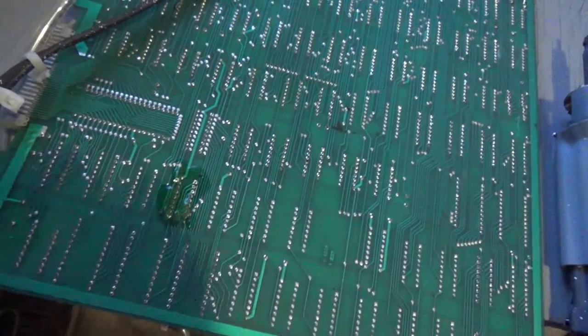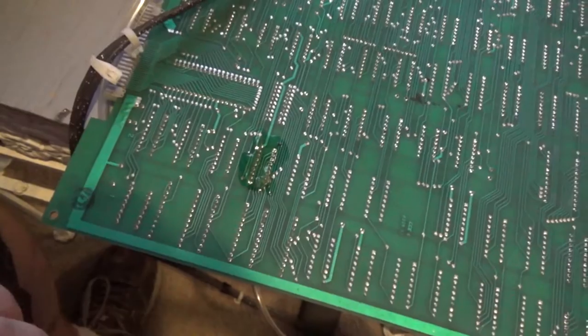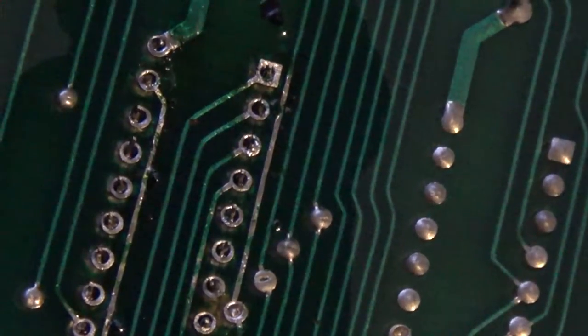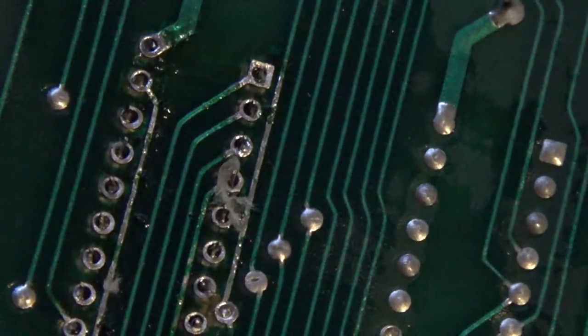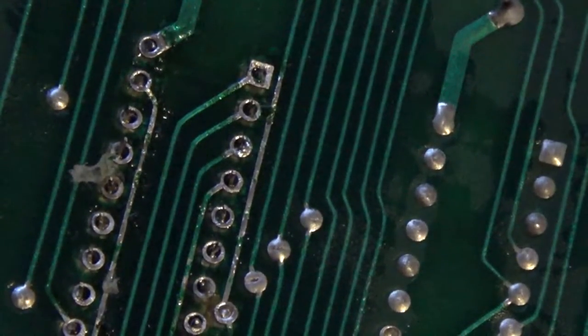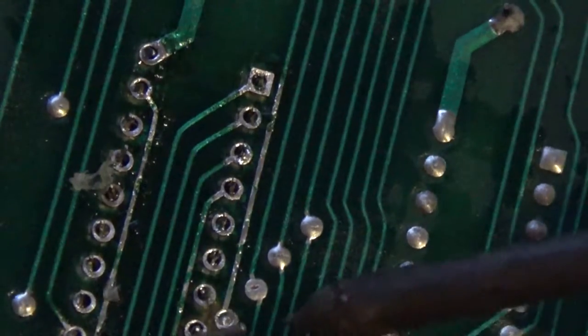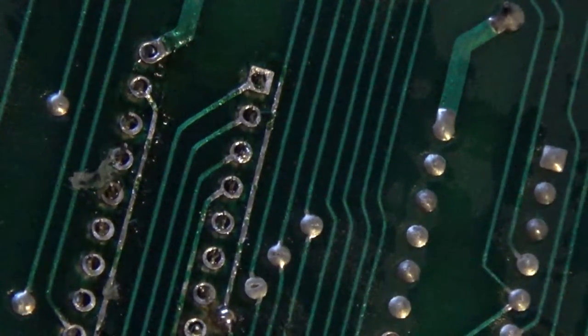Let me zoom in. See how I kind of removed those three chips there? I'm going to go ahead and remove the rest. Okay, I desoldered all the pins. I'll get a paper towel just to get some of the flux off, because I'm going to flip this board over and I don't want sticky stuff on my hands. Now I did notice when I touched a little area right here I sucked a little divot out with the desoldering iron. I don't like that — it's probably just fine but I'm uncomfortable with it, so I'm going to go ahead and fill that in.